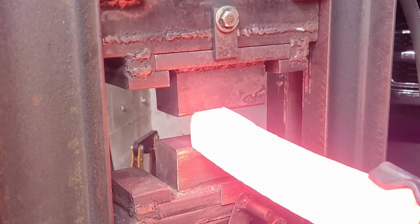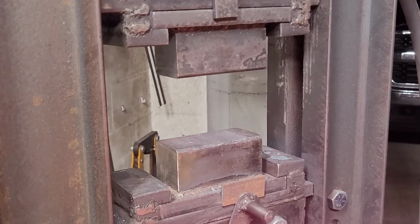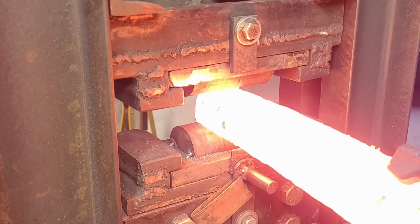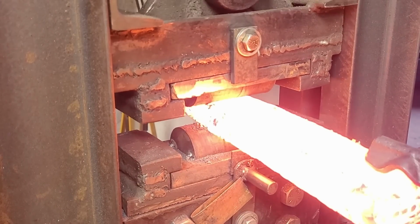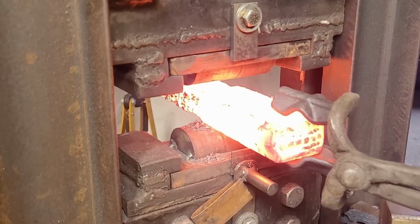Now the white spray paint has to be white spray paint because it is the titanium oxide in the paint that makes it white, that also has the effect of creating a barrier that doesn't let the billet or the insides of the can stick to the actual can itself.